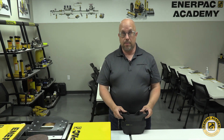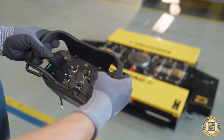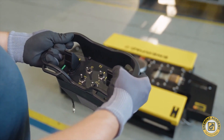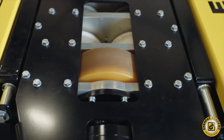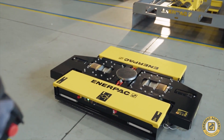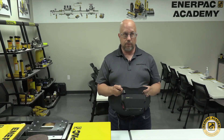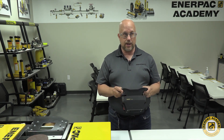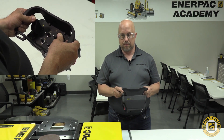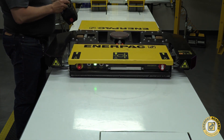The E-Mover is now ready to perform a demo or move a machine. There are two levers on the wireless controller to operate the E-Mover. Each lever controls an individual motor on either side of the unit. These motors will drive the wheels forward or backwards based on the direction the lever is moved. There are solid and open arrows on the E-Mover and on the controller to tell the operator which direction the unit will move. Press both levers in the direction of the solid arrow and the E-Mover will drive in that direction. Press both levers in the direction of the open arrow and the E-Mover will drive in that direction.